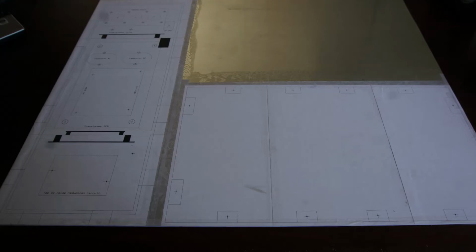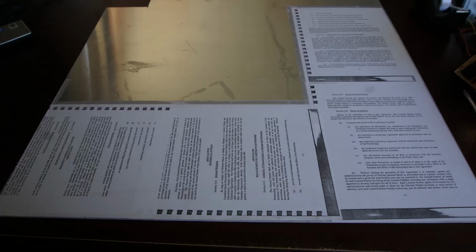There's a trick to gluing paper onto aluminum. First, apply a layer of glue to the raw aluminum and let it dry. Then apply the glue to the back of the paper and press it into place. Pre-gluing the aluminum helps. I've found that the bond is better. There's also a second trick. Glue some scrap paper onto the back of the aluminum sheet.